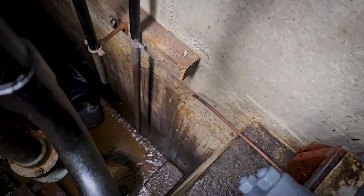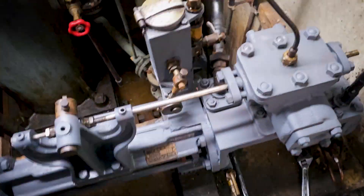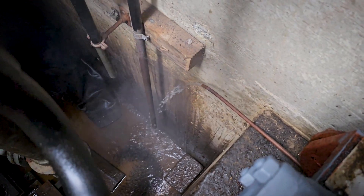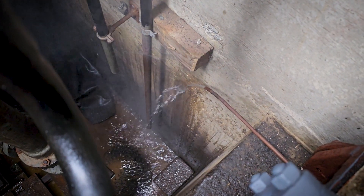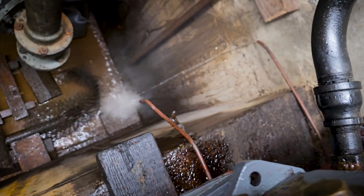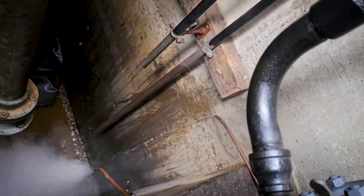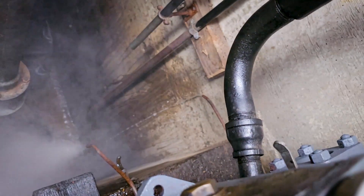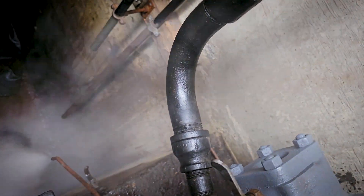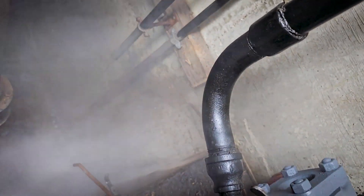Here's an example of how much water comes out of these things. We've got this pump here. We're just warming that through. I opened up the steam - you just see how much water's just coming out of the line and the cylinders. And this is just one side; the other side's down there. We've got a steam blow through on that one, which is what we want. The other one's still got lots of water in. So we're just going to turn it back down - just want to get all that water out, just a little bit of steam percolating around.